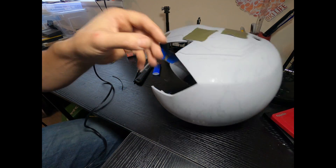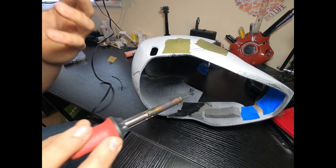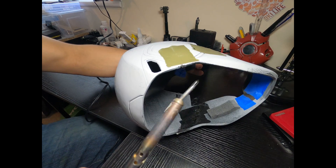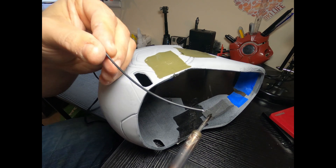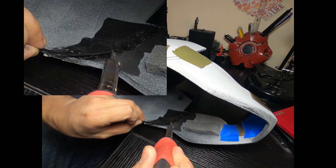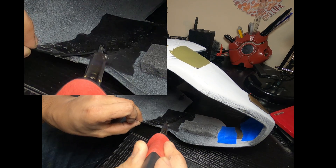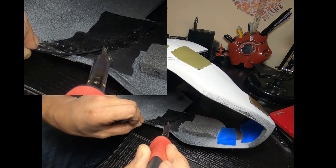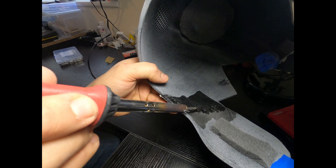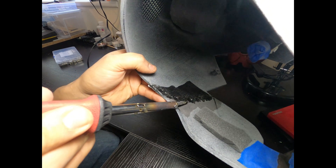Say you have a spot where the print is hollow — when you start to melt through the plastic you can blow through a wall and there might not be enough plastic to fuse. You can use this like stick welding or a 3D pen: take a little scrap piece or a piece off your spool, lay it in the seam, and add extra material by pressing down on it and letting it melt into the part. I've used this to fill little holes that I didn't want to put bondo or filler in. Melt until you have enough, pull the part out, and you have a little mound of plastic you can move around and smooth flush.